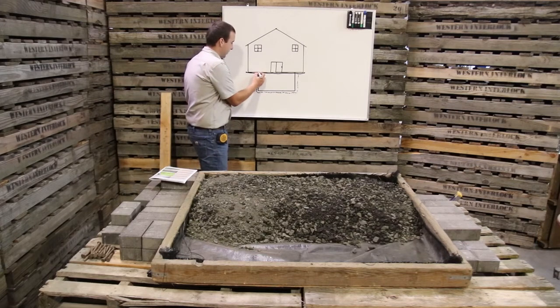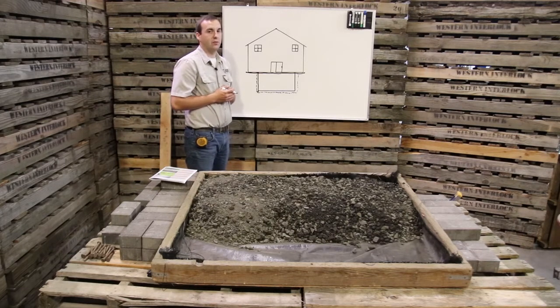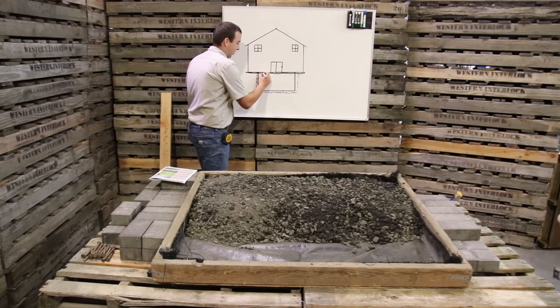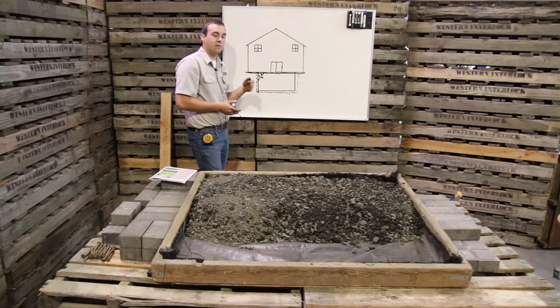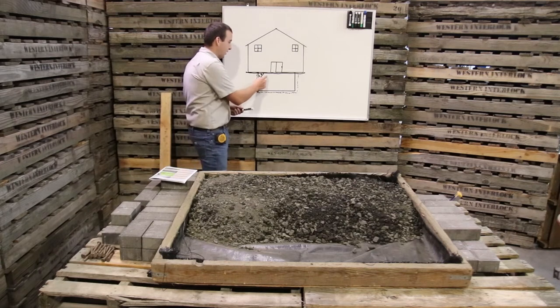Then to make a perpendicular reference line, go right along the edge where you want your paving stones to be and string it out. Then do what's called the Pythagorean theorem or the 3-4-5 method — we have a video on our website or YouTube showing how to do that. Basically, you measure three feet one way, four feet the other way, and get exactly five feet diagonally. This gives you a perfect right angle and ensures you're perfectly square. This helps most with laying the paving stones, but it's also good before you excavate for efficiency.